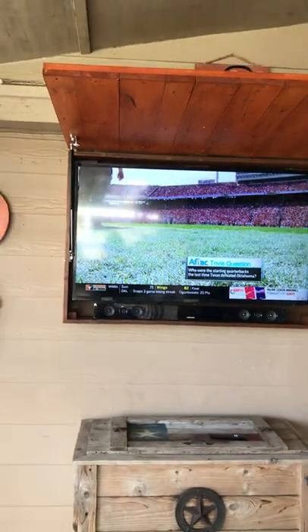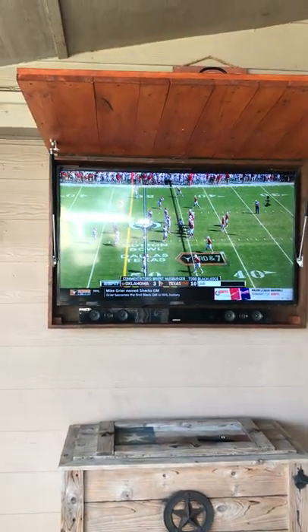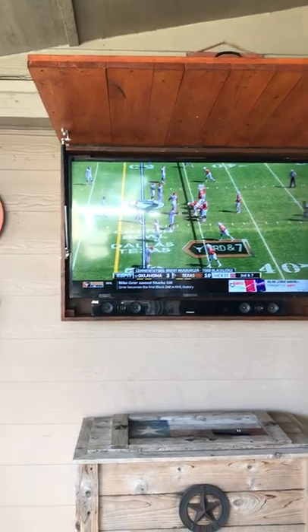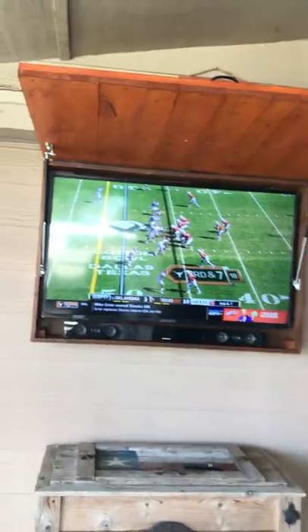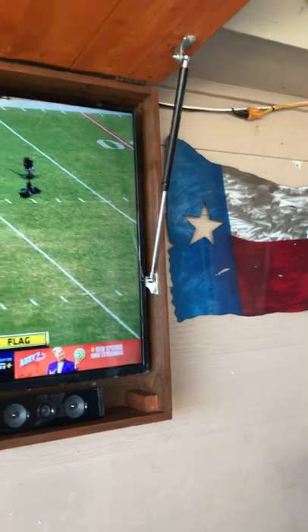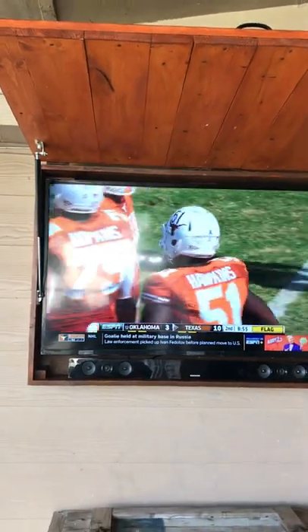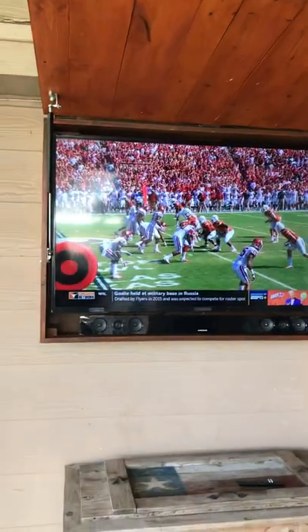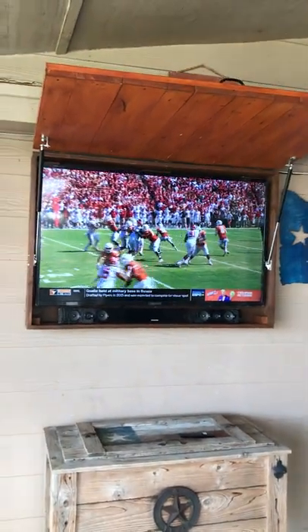But overall I like the way it turned out; I just wish I would have done a few things a little differently. If anybody wants to make their own — like I said, one-by-six all the way around. I used some old stock for the trim and new stock for the door. I would have left more space on the sides to compensate for the bracket, and put some thicker stock up top. I'm going to have to reinforce that up top because at some point it could rip the hinges right out. Just wanted to do a quick video and show you guys what I made — thanks for watching.